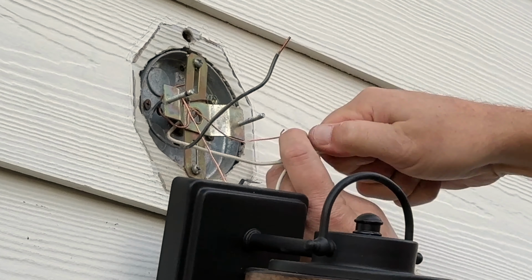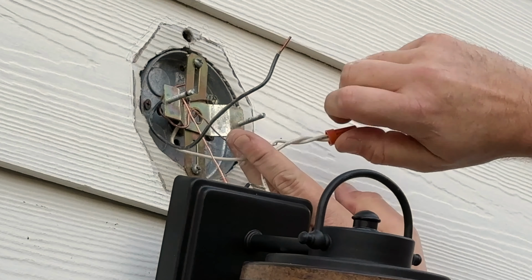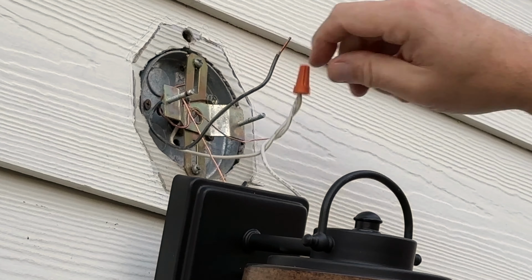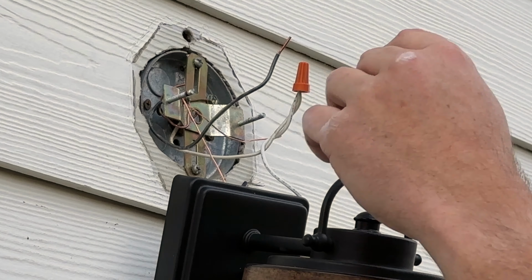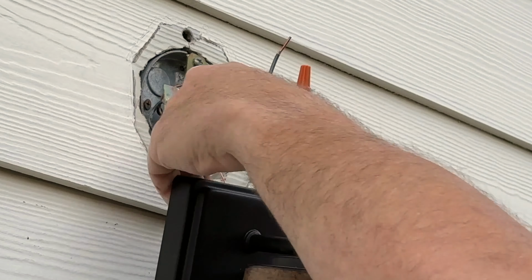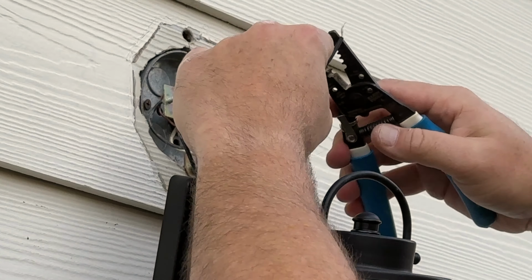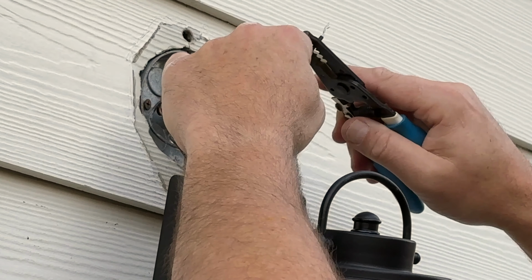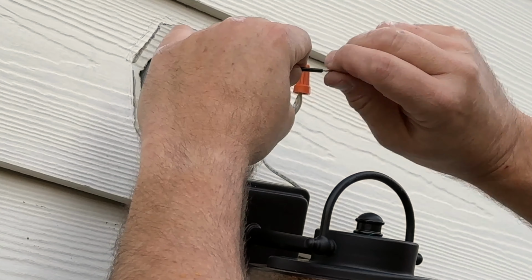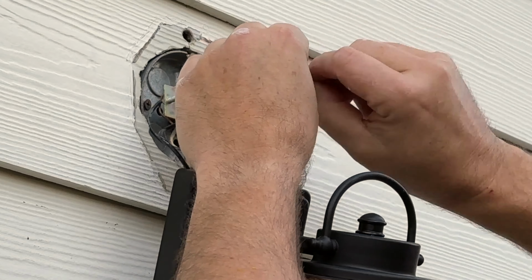first wire nut. I get asked a lot, how do you know when your wire nuts are tight enough? That's how you know. They're twisting around like that. They're actually twisting the wires a few turns. I like to go ahead and twist the wires a few turns because, I guess, you're taking some of the load off the wire nut and you're putting it onto the wires. And so it just kind of helps guarantee that thing stays connected in there, doesn't ever start to spark.